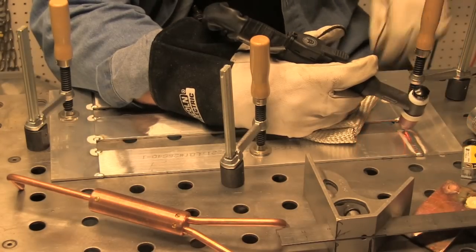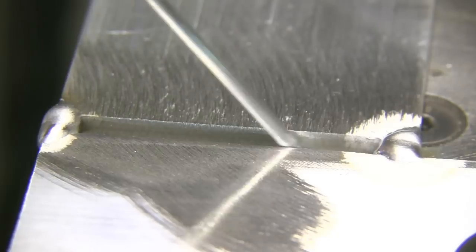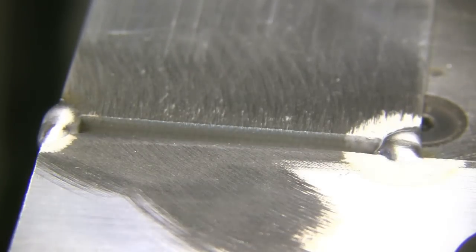We're just welding up all these little butt joints here. You can look at the tip of that electrode — all I did for electrode preparation was put a blunt taper on it with a cheap diamond wheel and then just weld it. I didn't round it using the AC balance or on a piece of copper or anything. When you have a nice blunt taper that's tapered to a sharp tip, it'll ball by itself, but it won't ball before you get a nice crisp start at low amperage on an edge. That's why I prefer this to balling the electrode.